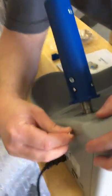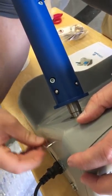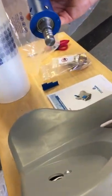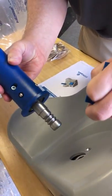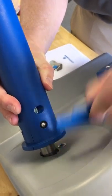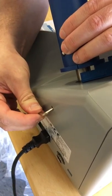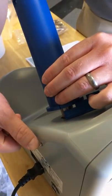To loosen up the mandrel there's an Allen head back here and we're just going to go ahead and loosen that up so we can adjust this. The mandrel comes not attached to the machine when you get it, so you will have to put that in. Here's our little guide and we will go ahead and set this to 18mm. You don't need to have it super tight, just snug. So we got that at the right setting.